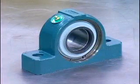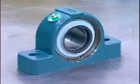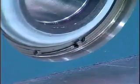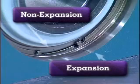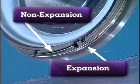Dodge Imperial bearings can be converted from expansion to non-expansion and vice versa. Simply move the snap ring on the back side of the housing from the outside groove to the inside groove to switch from expansion to non-expansion. Do the opposite to convert from non-expansion to expansion.